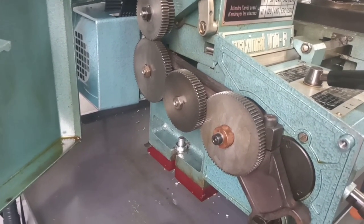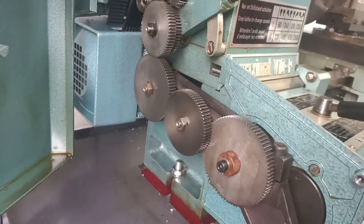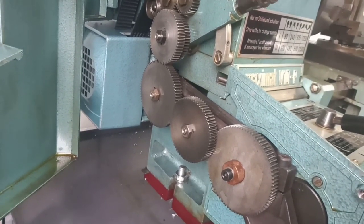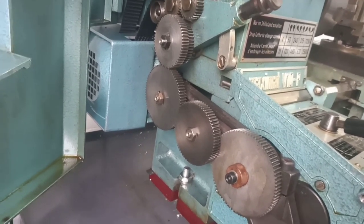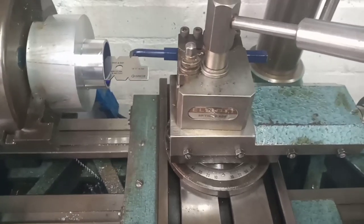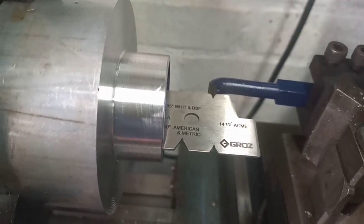Looking at the universal quadrant fitted to the lathe — that is the gear train the book specifies for 24 TPI. It was a matter of moments to set that up; I didn't have to use any wheels from the other quadrant setup — you're provided with plenty of change wheels in the set. That'll make for a quicker swap-over when I put the lathe back to its normal metric running format. Now we're back at the business end of the lathe — the threading tool is set up square to the job and on centre height, checked square using the fishtail tool to ensure it's perpendicular to the path it will take in the bore.